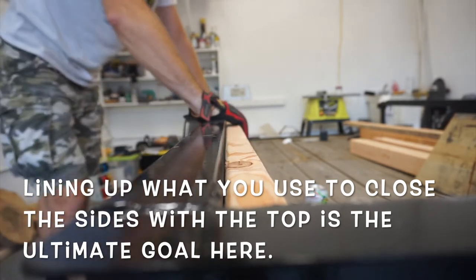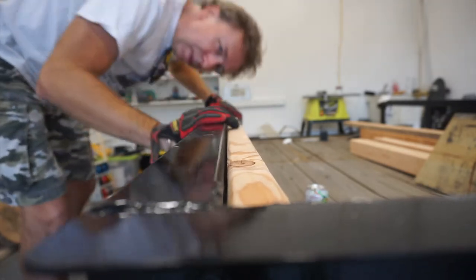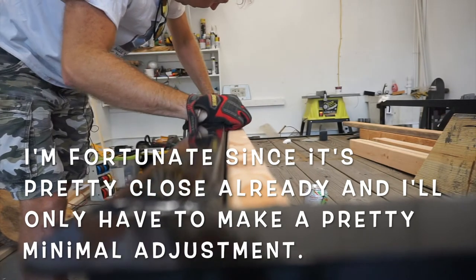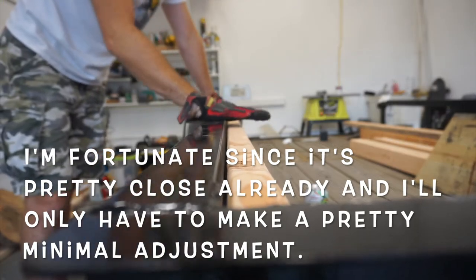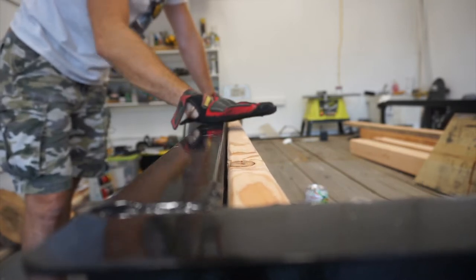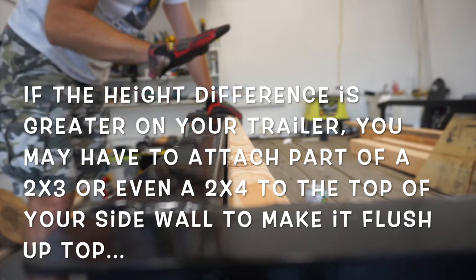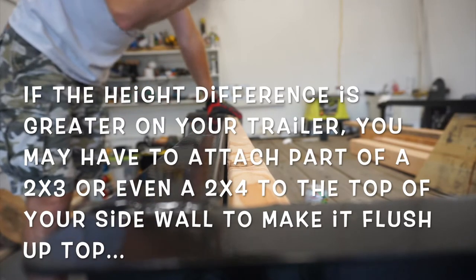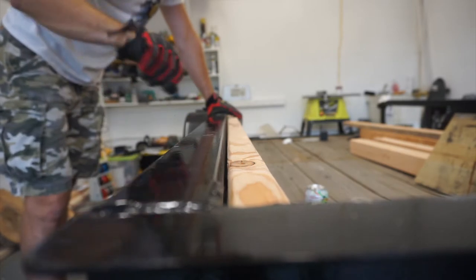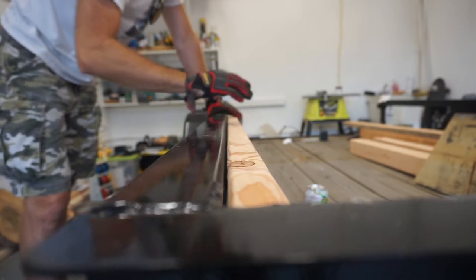What you really want is for it to be flush — but it's not completely flush; it's about a half inch lower. So what we're going to need to do is raise this up so that we have one flush wood-metal surface here, because what's going to happen is the next two-by-twelve is going to go on top of this and come out this way. So if we don't have that flush, then this can't sit on there properly.